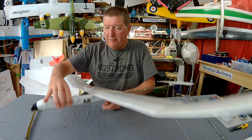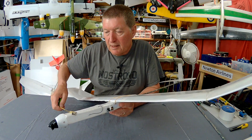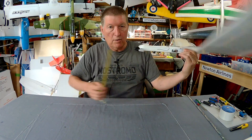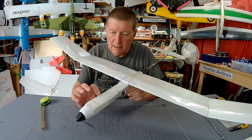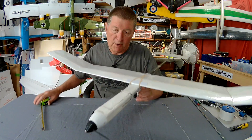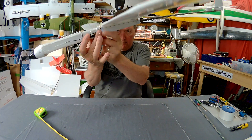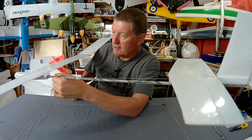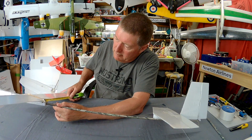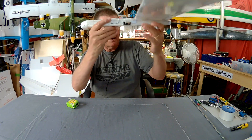The fuselage is made from 6mm Depron sides and top, and 3mm Depron on the bottom — just a tube to fit your components. It's 45mm wide and 30mm deep. I'd suggest making the next version a little bit wider and deeper, maybe 35–40mm deep. From the front of the wing back I've tapered it to encase the boom, just for aerodynamics, tapering down to 20mm by 25mm.